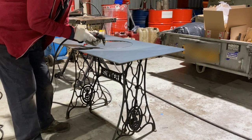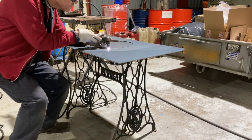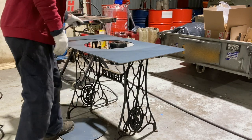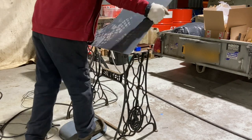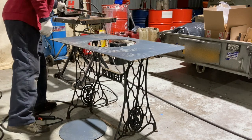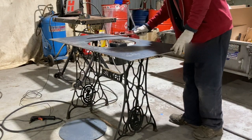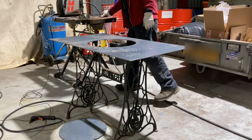There's one little bit that didn't quite come off — I'm just going to cut through that, slice through it, and hopefully a little nudge and that's it. Now I'm going to flip it over so the chamfer I put on that cut goes the other way, knock the dross off, and that is a nice clean cut. It will take very very little clean up with the grinder just to make that look tidy.